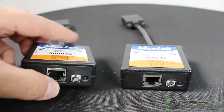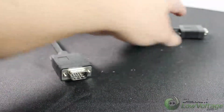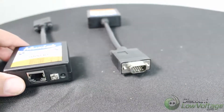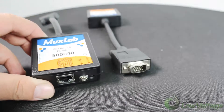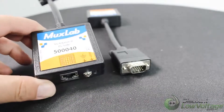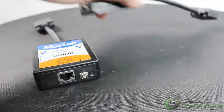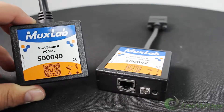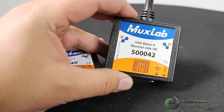These are made in Canada and carry a lifetime warranty. This kit can transmit video up to 350 feet. It works with laptops, PCs, plasmas, CRTs, LCD monitors, and DLP projectors. For distance versus resolution: VGA at 640x480 goes up to 450 feet; SVGA goes up to 350 feet; XGA up to 250 feet; and SXGA up to 200 feet.